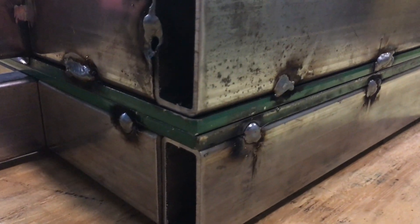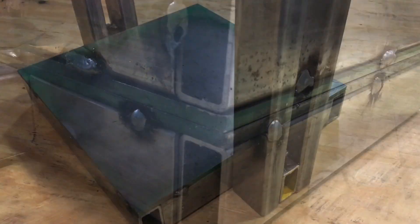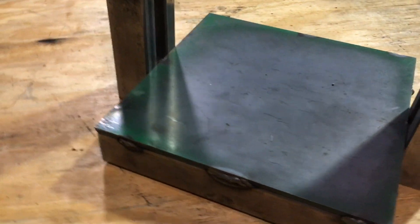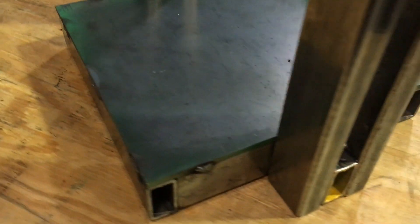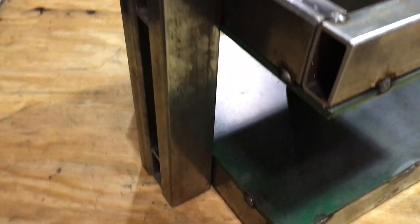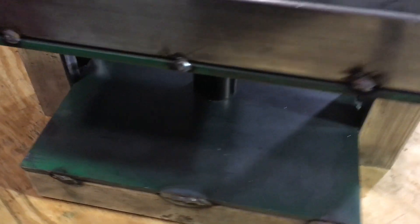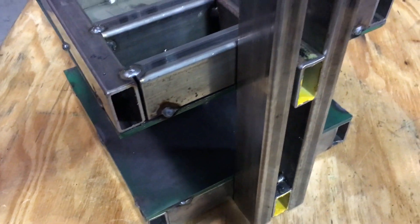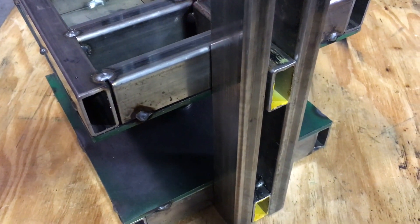I can see here that both mating surface plates are aligned very well. With the fixed plate upside down on the table, I can tack the side rails into place. With these four side rails tacked onto the top plate, I set the traveling plate into place, leaving a temporary spacer to help align the rails before I weld additional.